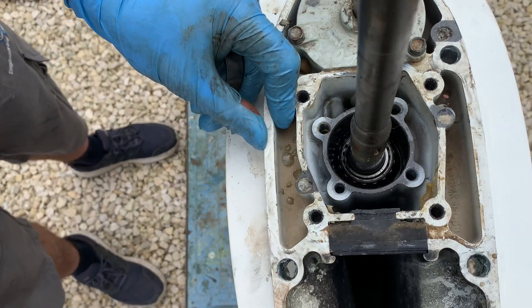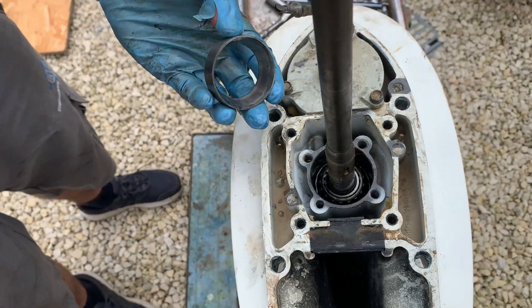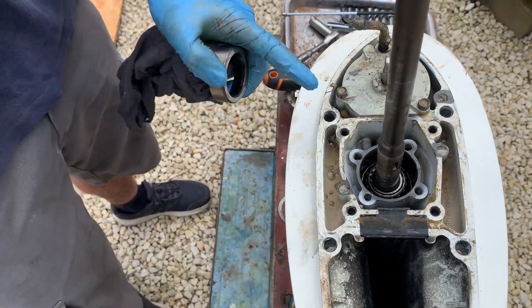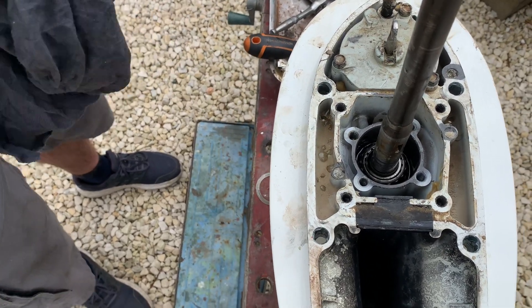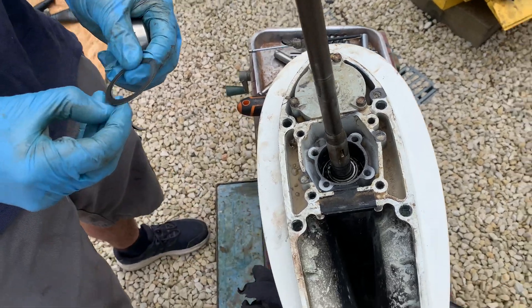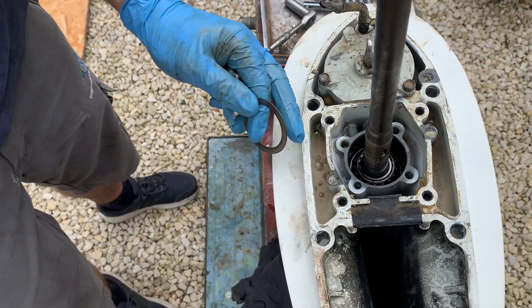What's going on down there then? Well, that's where the race is removed, so that's the play we had. Obviously if we put the bearing race in and re-shim it we should lose that play — we should be back to a nice solid. Has that popped up with use or popped up from the start? I think it was assembled incorrectly to begin with, to have that much play.